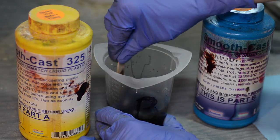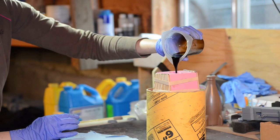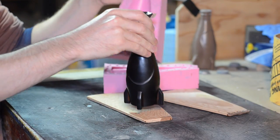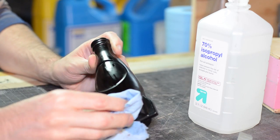With everything set up, we pre-mixed all of the side B we would need with the tint, so each of the layers we poured in would be exactly the same ratio of tint to resin. Then we mixed up one layer at a time, poured the layer in, and slushed it around on the inside of the mold. I added a cardboard tube to the mold to make it easier to roll around, and slushed it for about five minutes per layer until it started to set up, then added the next layer. We had three layers of resin to coat the inside and make a nice thick shell. Once cured, we popped the copy out of the mold. I trimmed the pouring spout off the top, cleaned up the entire surface using rubbing alcohol, and cleaned up the seam with a knife — just a little bit, since I wanted it to look like a manufactured bottle and you can always see the seam on those.